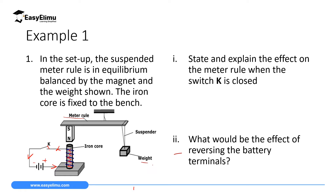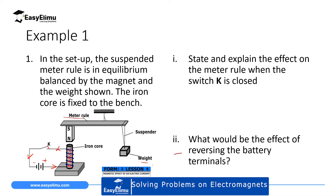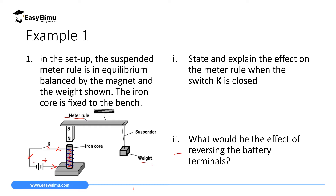To determine the poles produced on this soft iron core inside the solenoid, we use Fleming's right-hand grip rule, which states that if you grasp a solenoid carrying current with your right hand such that the fingers curl in the direction of current, the thumb points in the direction of the north pole. Here, if you grasp with your right hand, the fingers in front point to the left side of the screen, therefore the thumb points downward.